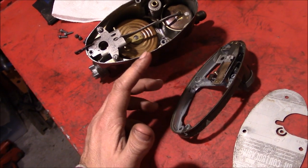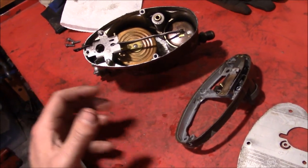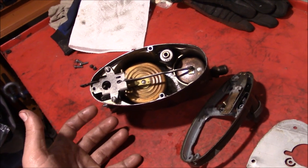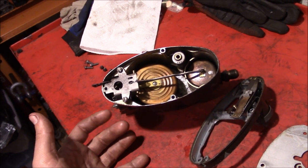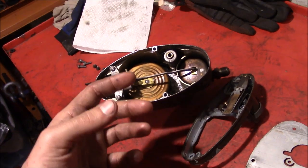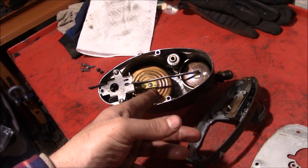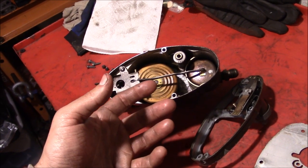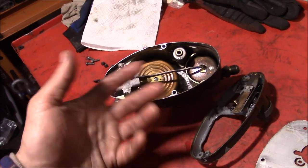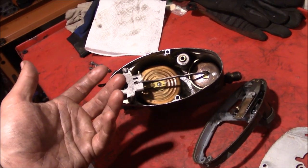I just love these old-school pieces of mechanics and machinery like this. Things like this can work for decades. I believe the one in our camp was working for 60-plus years in its current state and never had any problems. I had to take it apart and service it because the float here, the main float, had developed a pinhole in it. But being that it was brass, we were able to solder it back shut and bring it back to life. Who knows — it might get another 50 years out of it.